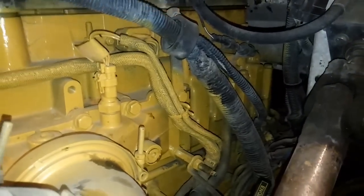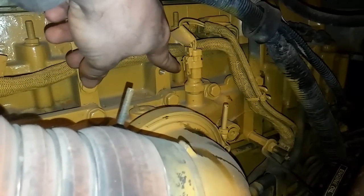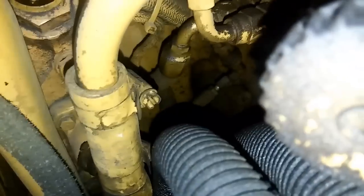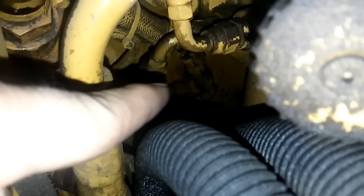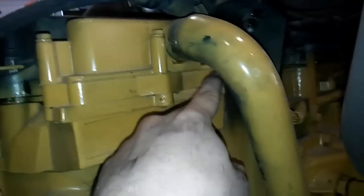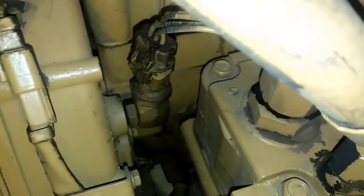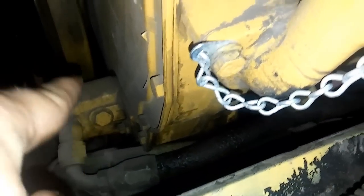We're on the intake side of a C13. We have your injector harness up here going through your valve cover base, your boost pressure sensor. On the bottom side we have your intake air temp sensor, your fuel pressure port. This is your fuel return line coming out of the back of the head on the side, which is fairly easy to get to compared to a C15. Under where that line goes on the bottom of the fuel filter housing is your fuel pressure regulator. Your oil pressure sensor is on the block right there. We have your fuel supply line to the head on the front, your crankcase breather and mesh breather filter, your camshaft position sensor and atmospheric pressure sensor on the front structure, and your fuel pump.